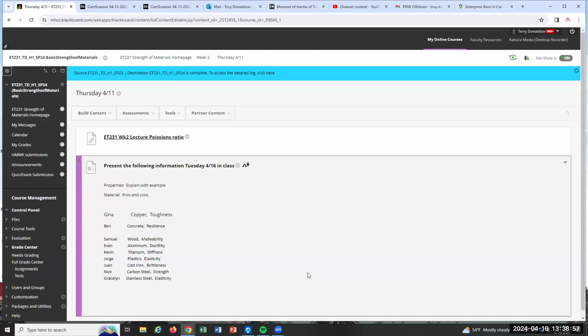Excellent. Well done. Ben, tell me about the pros and cons of concrete. What do we like about it? What do we not like about it? Concrete is incredibly durable. These are the pros: it's a very long-lasting material, and it has various applications like bridges, roads, and structures, and they don't break easily. But if you whack it with a hammer, it does have a tendency to crack. And it takes a long period of time to prepare and install. For improving tensile strength, you would have to reinforce the concrete before you pour it in with rebar or some other metal mesh or steel bars.